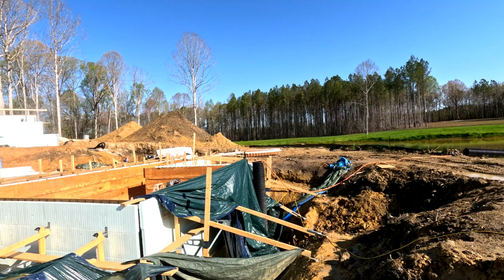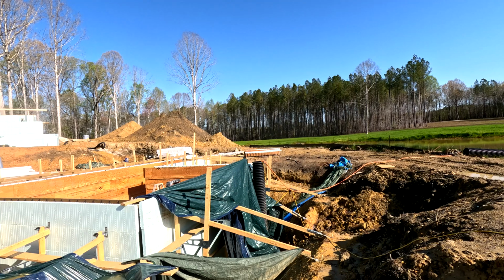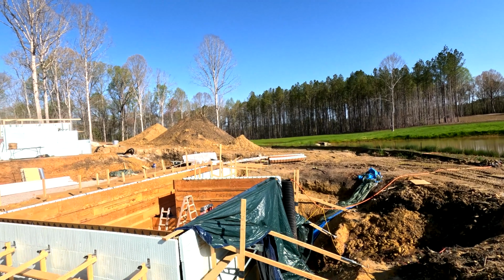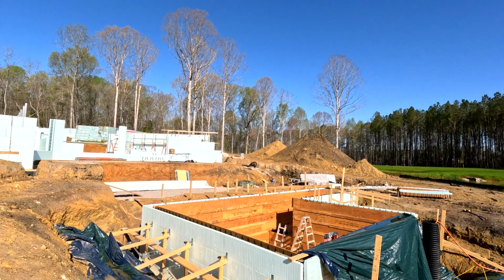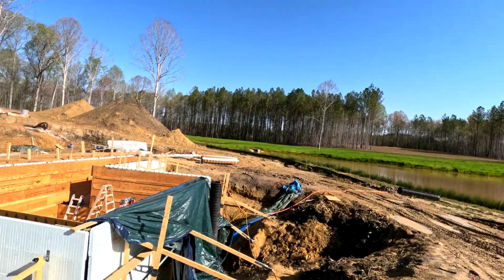So I'm gonna go get the tractor and bring rebar down here, because now it's time to do the vertical bars in the pool. Aaron wants them every 16 inches. So it's roughly 65, 70 straight bars. By the way, 3 inches of rain and never flooded, just that little pump. So feel good about that, especially since we're gonna do some cleanup on all that later.